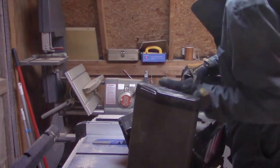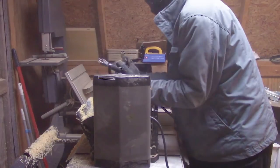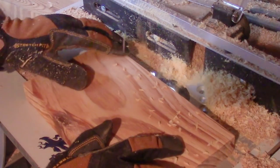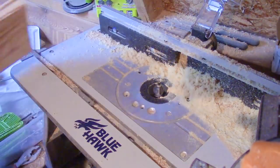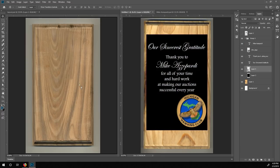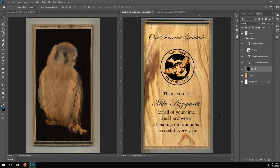So I went back to the trash box and grabbed another board that I thought could work. I think it's just a thick chunk of pine or something — I don't really know my woods very well — but I gave it the same treatment: planed it down, squared off the edges, gave it a quick sand. With confidence this time, I proceeded to rout the edge. It went well and the board looked good, though it was an interesting piece — pretty saturated with sap, kind of waxy. With two decent plaque blanks, we decided to just make two plaques, taking the bird from Lisa's original design and making it a separate plaque.